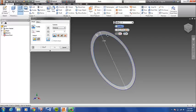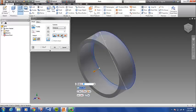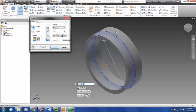Okay, we're going to extrude the ring. Now I want to do a mid-plane extrusion so that in the next coming steps we have this original sketch in the middle of the tire. As far as the extrusion width goes, that's not specified. It's something we can measure on the Armoblox vehicle. I'm going to estimate it at 0.5 of an inch.